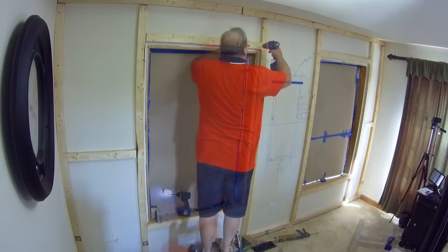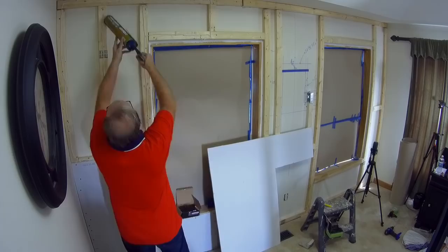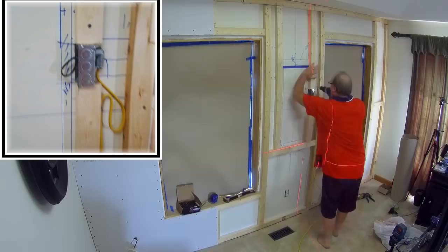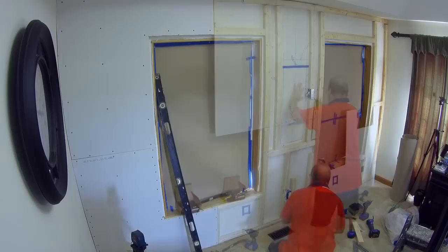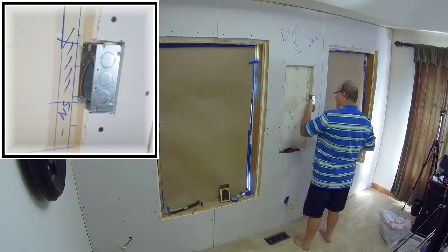As well as 400 pounds of synthetic stone — all that weight could come down if it's not well attached. So make sure you find existing framing structure as much as possible. It really didn't cost that much to add the wood and the drywall, but it gave me the depth I wanted — I only lost about two inches of my bedroom. Here I put a two by four rectangular box on edge on the wall, tied it into existing framing, and ran the electrical wires down inside the new framing. I put an extension box down where the original outlet was and brought the wire right out — a nice, simple, elegant solution.